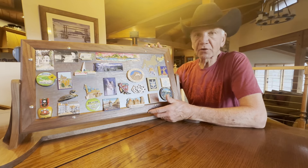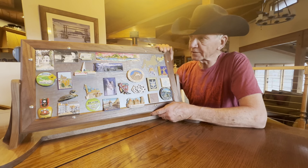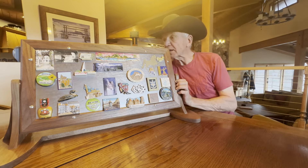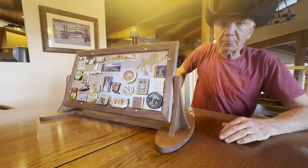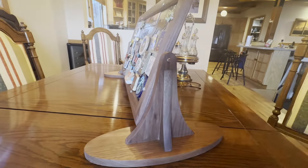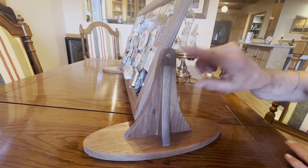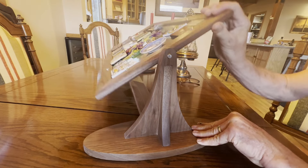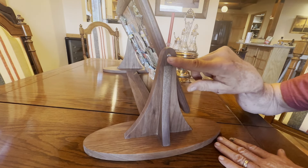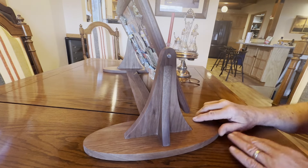The frame is literally bolted onto the steel plate, so it makes a really sturdy frame and it holds that steel in there pretty tightly. I'll go into the details on that and on how to make this pivoting structure. It pivots on a 10 millimeter steel pin and that's what makes it spin around so you can use both sides. I'll also give you some tips on how to do the cutting with the Shaper Origin CNC router.